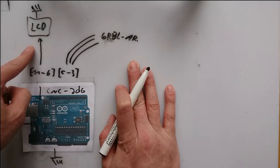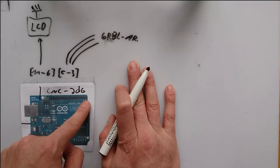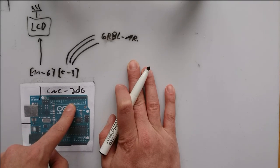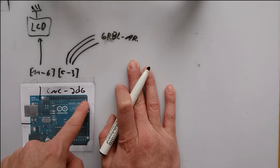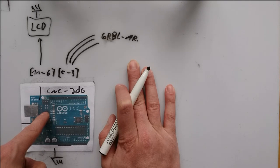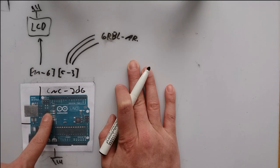The Arduino ports 0 and 1 are connected to the serial chip, to the FTDI chip, which normally is not a problem, because the serial chip can be switched off. The Arduino that I have used here is actually a cheap Arduino clone, which apparently has another FTDI chip or something, and it seems that it always influences the ports. I ended up using the ports 0 and 1 for less sensitive things.